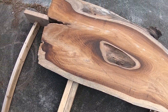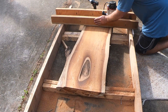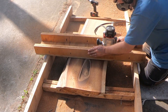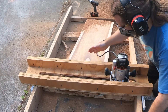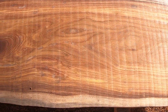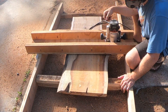In flattening, we wanted to remove that divot there just to make a nice smooth tabletop. So circular saw and router sled — time to get to work. All in all I had to remove about three-quarters of an inch of material to get it all down flat. Once I did, oh man, it looks pretty nice. I took off a little bit on the bottom as well just to bring out a little bit of the grain and freshen it up. Overall it was about an inch thinner than it started out.